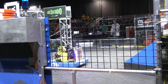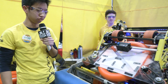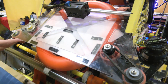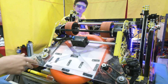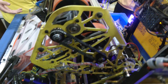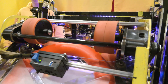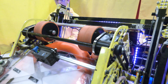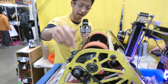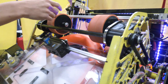Let's pass over to Kenneth, who's going to talk more about that note journey. You've got a cool elevator with your shooter and amp mechanism, so let's talk about it and demo it. So the first thing that the note touches going into the shooter are these feeder wheels out here, and this is already something we changed. On our original shooter, we had a basic feeder going into the shooter as though the note was already going to be centered. However, we realized we need a wider angle for the note to be received into the shooter accurately because we were having so many issues with notes getting stuck. We have vertical compression on the notes along with horizontal compression provided by 3D-printed passive rollers. This allows our shot to be extremely powerful and very stable. Originally we planned to have the wheels on either side of the ring when being shot out, but we found that didn't put enough spin or power on the shot, so we opted for a vertical compression of half an inch.